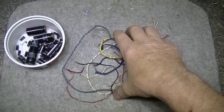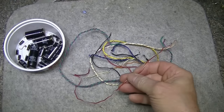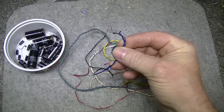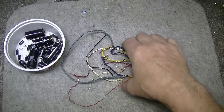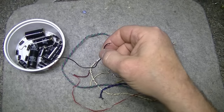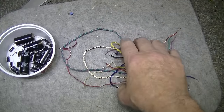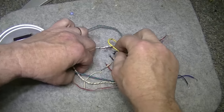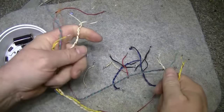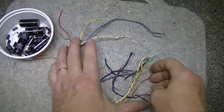All right, so here's the wiring I ripped out of the receiver and replaced with heavier gauge. This all reads 24 AWG. Now, I didn't measure any of this, but this is stranded core, and it's, I don't know, inadequate in my opinion. That wasn't the piece, so the rest of this was. Yeah, so quite a bit got yanked out. These twisted pairs, these are all on the speaker lines. You can see how much thin copper they had in that, going back and forth to switches and amps and stuff. Okay, let's get rid of this.